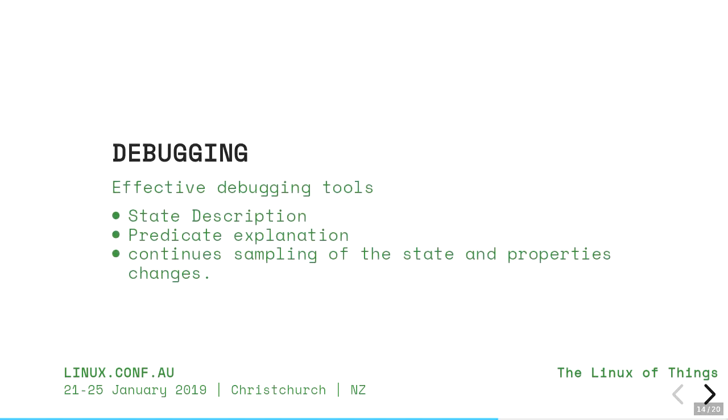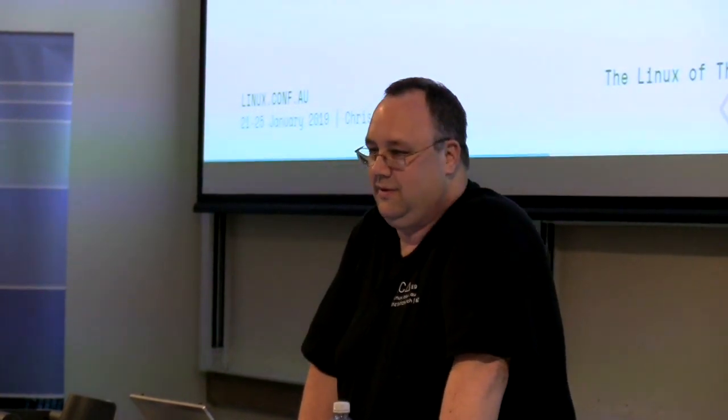So debugging is actually one of the biggest problems in the industrial world. The way they do their debugging is a polling-based solution, and they only show you the I.O. that will fit on your little screen or that you've turned on in the debugger. So if the problem you're having isn't in the area you're looking, or in the area that you've got a debug list of I.O. turned on for, you won't see it. And all in that, you may only get, if you're local, 1,000 updates a second, one update per millisecond. So that was a significant problem to me.